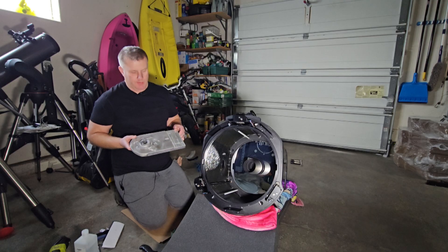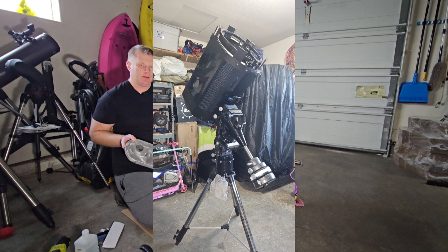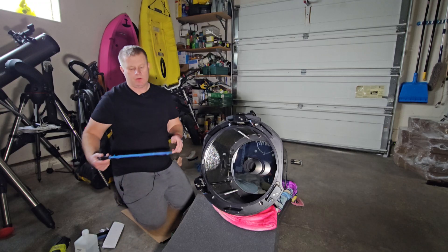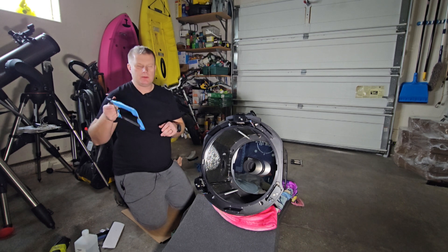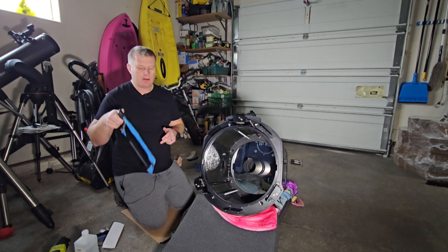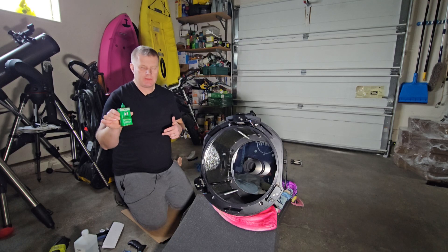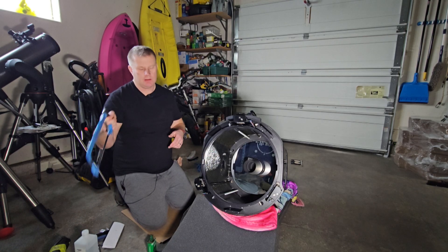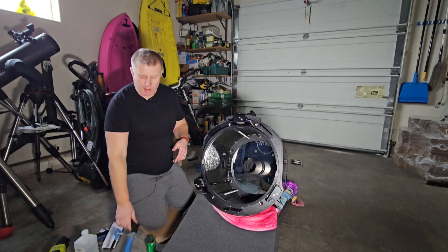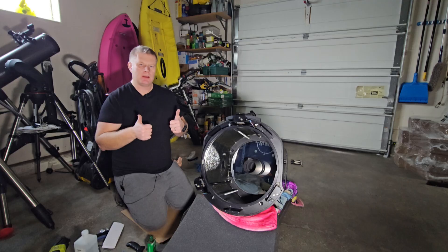For the next video, I'm most likely going to clean the primary mirror in place, so stay tuned if you're curious about how to do that, along with some scope assembly. Before I close out: a couple of tips — when sawing, putting painter's tape on the saw itself really helps you not scratch up the finish. Also, aluminum cutting lubricant specifically made for cutting aluminum works great, or if you don't have that, WD-40 works really well too — it keeps the blade from binding as you're cutting. Thanks for watching! Please leave any questions or comments below, and if you're not subscribed, please do consider subscribing. See you in the next video!